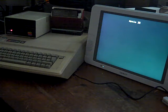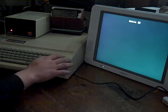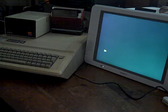The last problem I showed, with the screen corruption and the E10 error message, was that the EPROM had failed. I had the image I'd already downloaded off the web, because I've got all the Apple ROM images in a file I managed to find on the web. So I looked through it, found the correct ROM image for this computer and burnt it to an EEPROM, which was harder said than done.